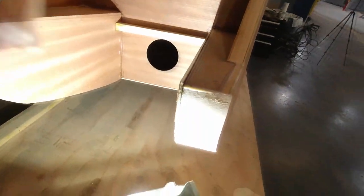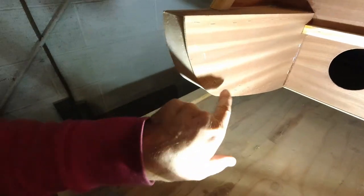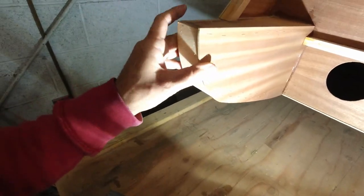I may consider doing that with the fuselage over on its side, because this epoxy, when it's in a vertical format, if I don't have silica in it or something, it's just gonna sag. So I'll probably set it on its side and then do one at a time, and get those in as I'm doing other things. I can take my flush router and route this piece. I can pull all the staples out that I put in and get that taken care of. And then we can go